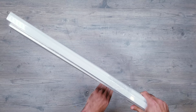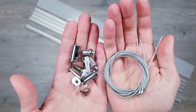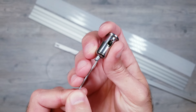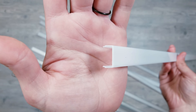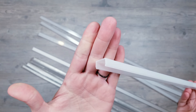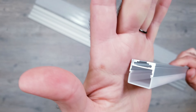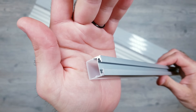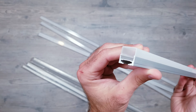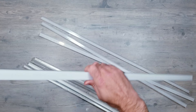This is probably my overall favorite diffuser channel design. It has a couple different mounting options including traditional wall brackets or the ability to hang it from the ceiling using a wire system. It has a flat top so any angled cut you make for corners should butt up perfectly against each other. I love how the diffuser extends a little bit down each side so light comes out the top and also casts a glow left and right. The mounting track on the bottom for the wire system can also be used for running any additional power injection wires. The only reason I haven't used these yet is that they don't quite create a perfect neon glow with a 60 LEDs per meter strip — but paired with 96 LEDs per meter the results are very much perfect.